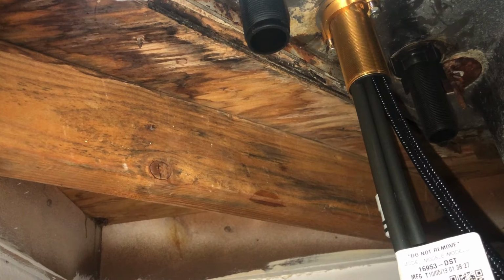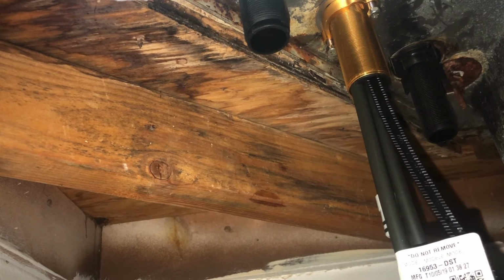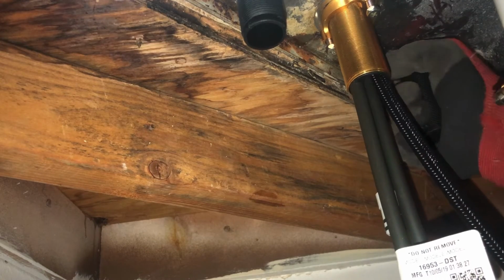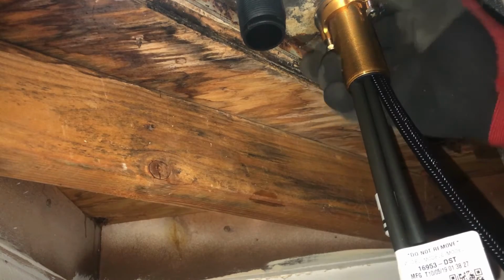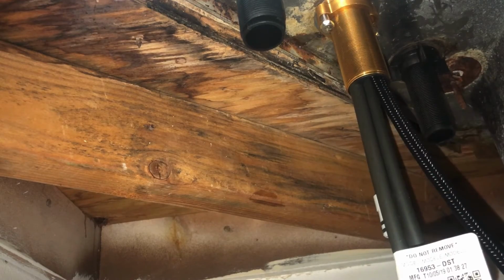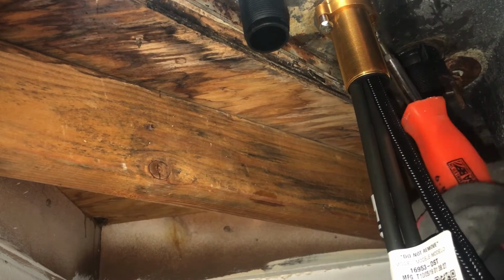So yeah, guys, let me know what faucets you like the best. I used to be a Moen guy, but I don't like how the Moen shank is real thin and it ends up always kind of fraying the hose, even if you use the little nut that they ended up inventing just so that it doesn't fray the hose. I've never had that happen with the Delta, especially in the past couple of years. Deltas have always been bulletproof. Even Delta shower valves, man, I mean, they're just bulletproof. They last forever. That's why they're such a pain to repair when it comes down to repairing them.